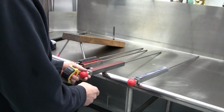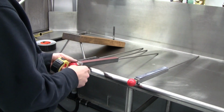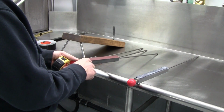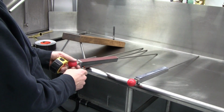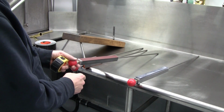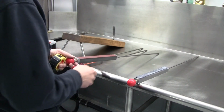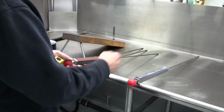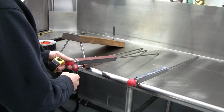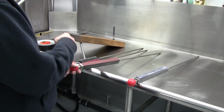And then after I did the 200 grit on the diamond stone, I'm using 180 grit sandpaper. This is called PSA sandpaper. I think it means pressure sensitive adhesive. So you peel the strip at the back and you just glue it on there, and when it's worn off you can just rip it out, wipe your aluminum bar a little bit and glue another strip on.